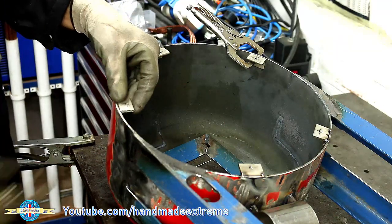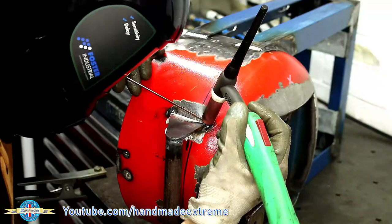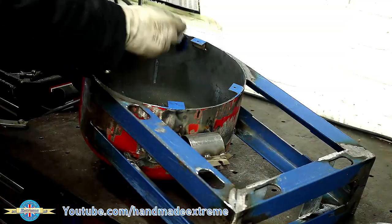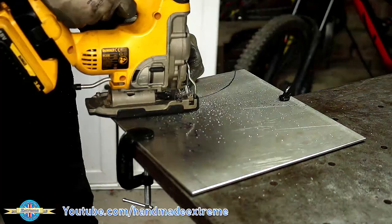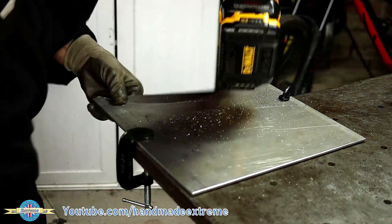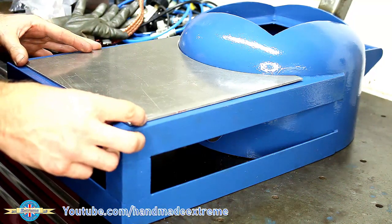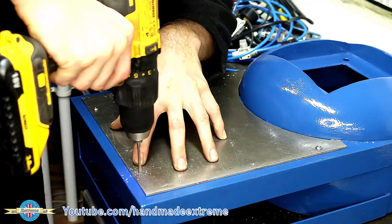I also added these little tabs on the inside so that I can attach a bottom plate, and then a little carry handle at the back just to help make moving it around a little bit easier. There's the mandatory coat of workshop blue going on. To make the skins I had some off-cuts of alloy plate — cut those out with the jigsaw with the woodworking blade, nice and slowly with a little bit of WD-40 as a cutting oil, works really nicely. I could then drill those through and mark the positions of all the screw holes.